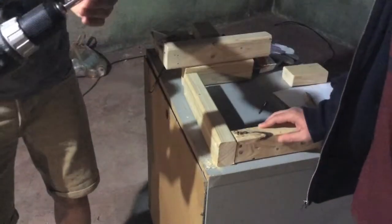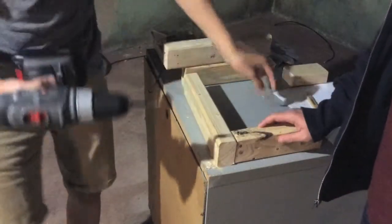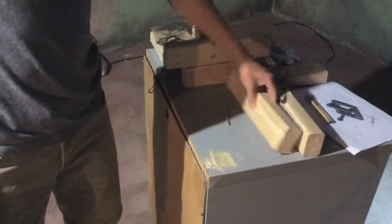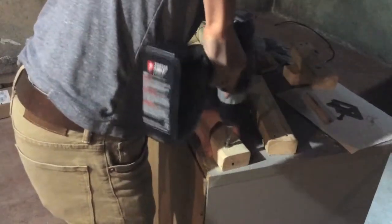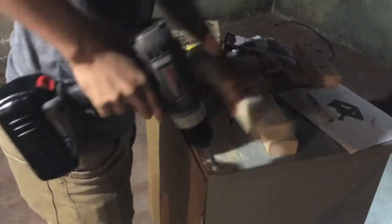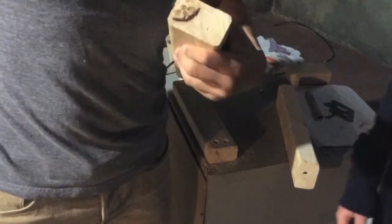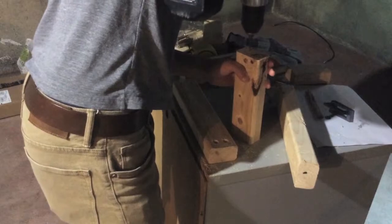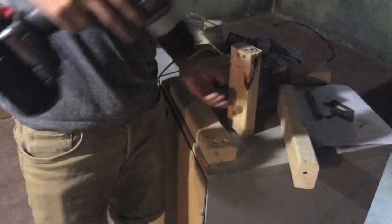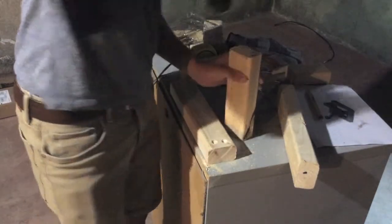So what's this for? This is basically the shape of a screw head. So when I drill in a little deeper... As you can see, the drill didn't get deep enough in, so at least it marked it off where I can drill the holes a little deeper so the screw can go in. Be careful not to wiggle around too much — that runs the risk of breaking the drill bit. Let the drill drive itself in.